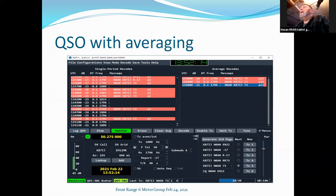And it's not that important, except I saw earlier today while running with Rich, I got a decode of Q38. And what that means is it took the previous 7 sequences plus the current sequence, it took all of those to create 1 decode. And so it was reading 8. And after that average decode, it reset it to 0. So that's what those numbers mean down there. Only one of the two numbers means anything to you while you're running, because you'll either be the left number that's incrementing on skips or the right number, depending upon whether you're transmitting first or transmitting second. That's the meaning of those two.